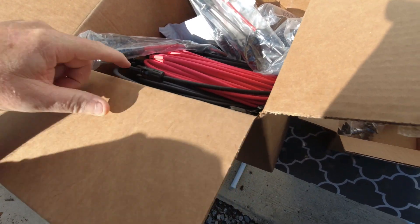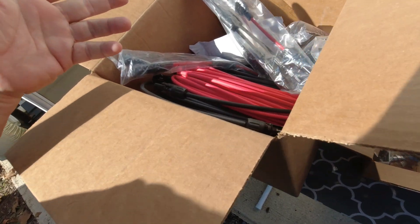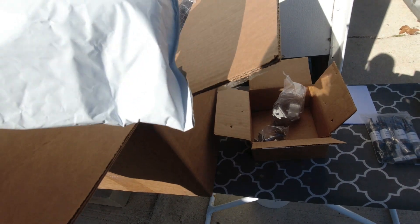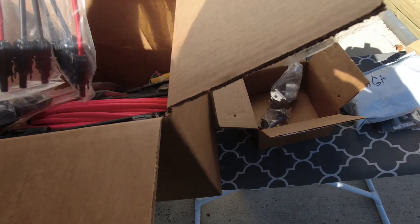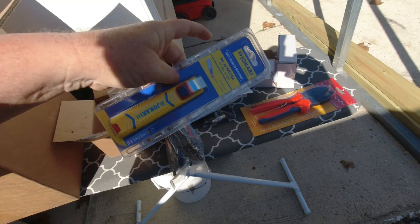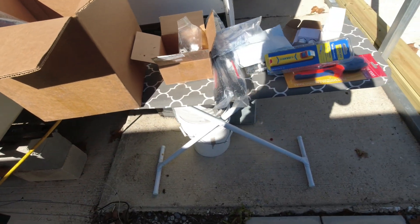In this box we've got some tools including the splice tool for MC4 cable ends. I bought two 25-footers which I'll need, and these hundred-footers were the same price as buying a hundred-foot roll. I'll cut one end off and splice it through. There are also special crimping pliers, male and female MC4 cable ends, double joiners which connect cables in parallel — you take the two positives from the two series strings and connect them — and a tool that cuts the outer sheathing really nicely.